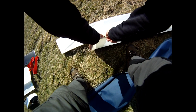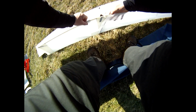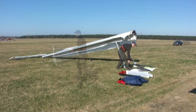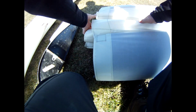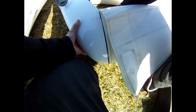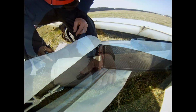The aileron and the flap have to be set up to bring tension into the sail. Therefore there are some buttons and some knee lever systems to bring tension inside. Look at the banding line at the hinge line. This line will be straight if the aileron and the flap are connected to the wing. This brings tension into the trailing edge. The end cap of this wingtip is also the support for the winglet.